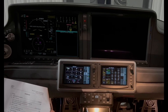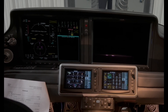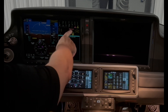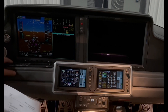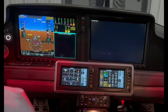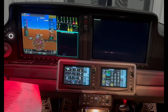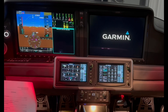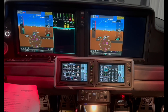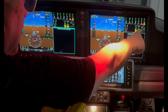It's dark because we're in a dark hangar, but it's coming up and I can see that we have 24.2 volts. We're looking for a minimum of 23, so that's good. Now BAT 2 comes on, we'll be able to see things a little bit better. And we're going to lower the flaps — one click, two clicks, and they display.